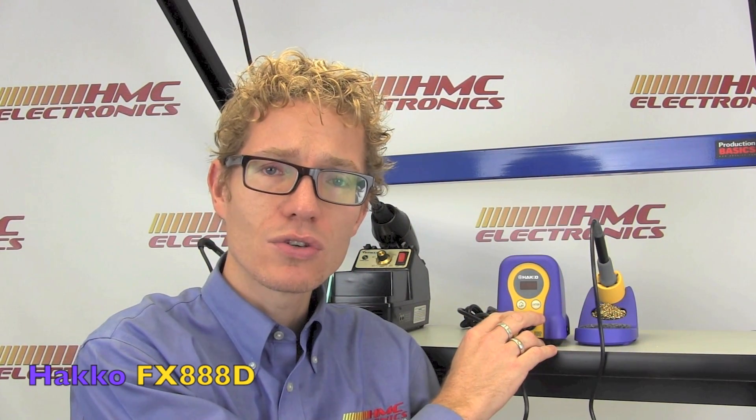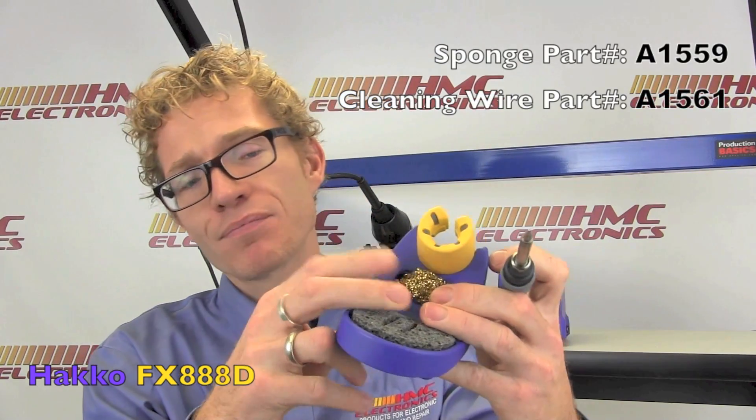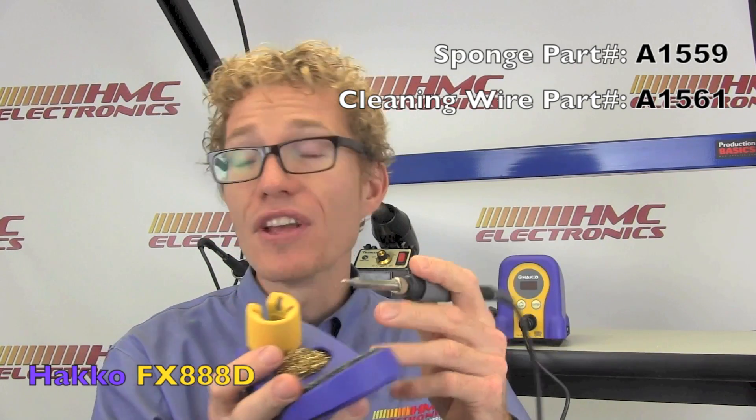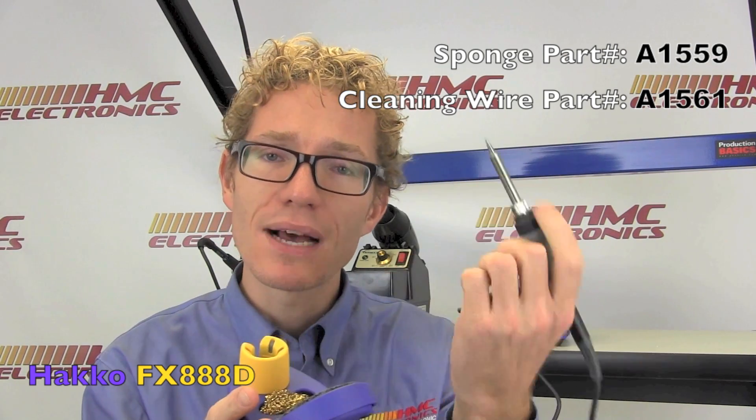It's super compact with a packed design as well. If you're struggling for space on your workbench — be it in your basement, front room, attic, wherever you've got your setup — it's got a very small footprint, which is quite handy. The Hakko station also has built into the cubby a sponge or a Brillo Pad wire-tip cleaner. The advantage of using a wire-tip cleaner is you're cleaning your tip without lowering the temperature. So a number of nice little features for the price point.